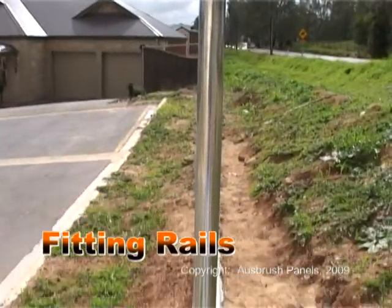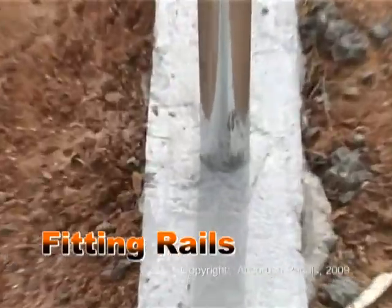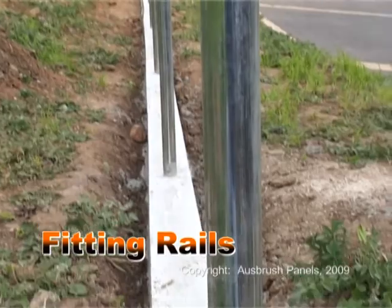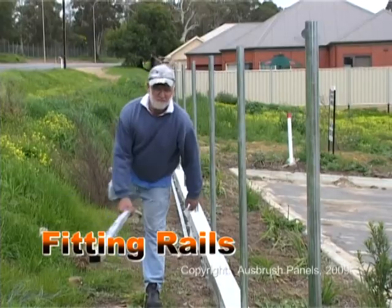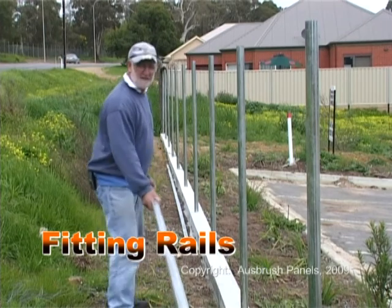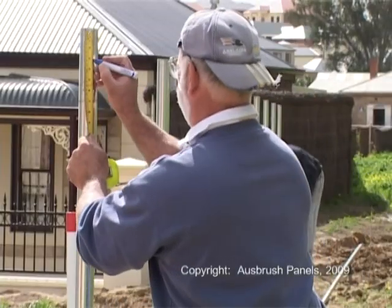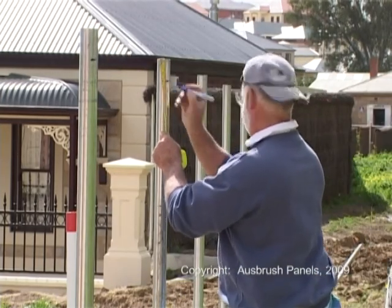With the inline installation system, the panels and base are centered on the posts. The panels fit between the posts, and the panel wiring tensions around the posts at each end of each panel. Only one rail is used at the top, and this is covered by the roll. This rail serves to oppose the tension in the wiring in the panels and also anchors the roll top.